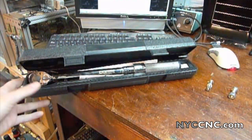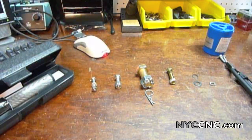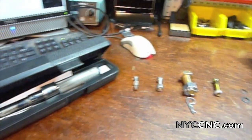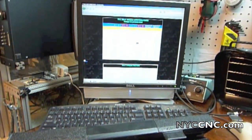First off, I wanted to start with the obvious: when you're trying to tighten any type of fastener, the thicker the bolt diameter is, the more torque you're going to get — which means the more foot-pounds of tightness or torque you're going to have. So I want to just show you a table.